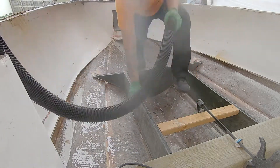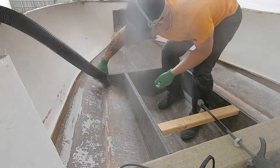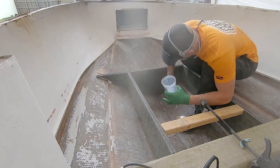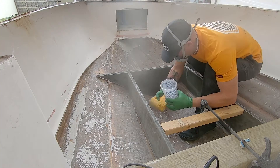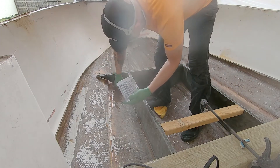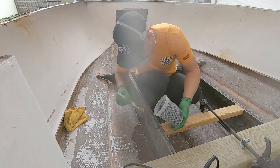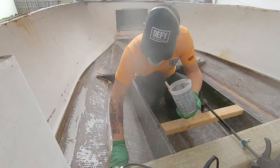While I'm vacuuming I'm also double-checking to make sure I haven't missed anything with the belt sander. In this next step I just poured a little bit of acetone into a cup and used a chip brush along with a microfiber cloth. I like microfiber cloths because they're lint-free, wash up pretty easily, and I can use them over and over. The acetone serves two purposes: one, to clean the area and get it prepped for glass; and two, the acetone melts the old resin on the surface and leaves it somewhat tacky for the new glass coming in. I put the acetone down and then wipe it clean before it dries.